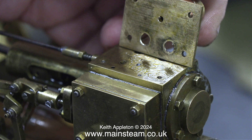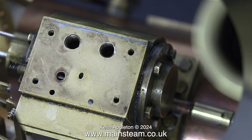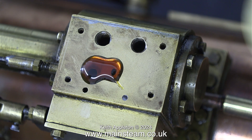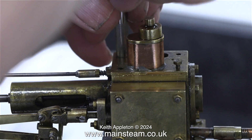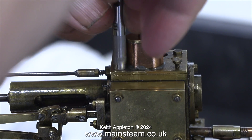The regulator on this engine is just a screw thread and I don't know what the hole is over the top of it — there is no way through to anywhere from this hole in the block. There are three holes in the cover: two are for the safety valves and one is for the lubricator to the cylinder. I'm screwing the regulator in and out to see what happens, and nothing happens, so if any expert viewers know what this hole is over the thread from the regulator I'd like to know. Before reassembling, I'm applying some steam oil, then wiping away every trace of it before refitting the cover plate, and I've decided to smear some Loctite 542 on the plate before screwing it back. I'm not putting any Loctite 542 on the threads of these small bolts — what made the job easier was the use of a nut spinner that fitted them perfectly.